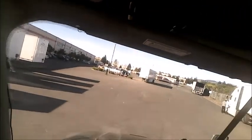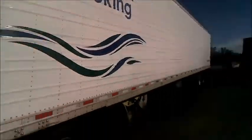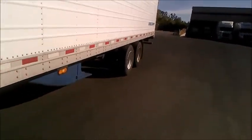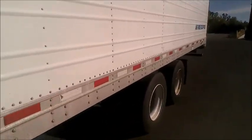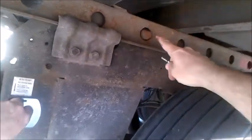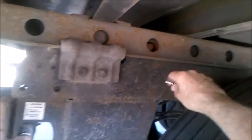Okay now, pop the brakes — I'll show you what we're going to do. Some of the sliding tandems have a handle you pull out; this one has a button you pull out. Just watch these pins — see them, see how they popped in.